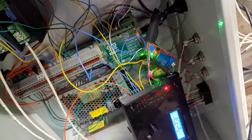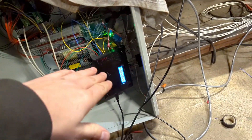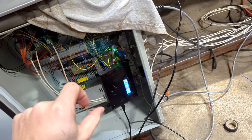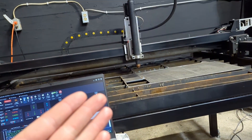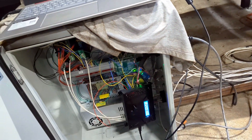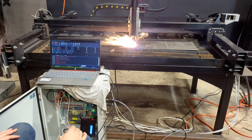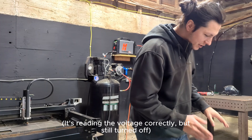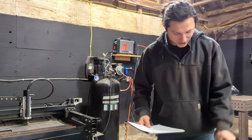And she worked! Good news — it was showing the correct voltage. Bad news — while scrolling through the menu, I must have accidentally turned that knob, so it accidentally turned on and was raising the torch up way too high to get to my 250 target volts. Now that I got it turned off, let's re-zero this and try that cut again. It's working perfectly! That's actually super exciting. Sorry if I was throwing a little shade there in my frustration.